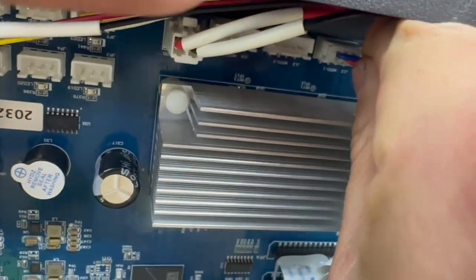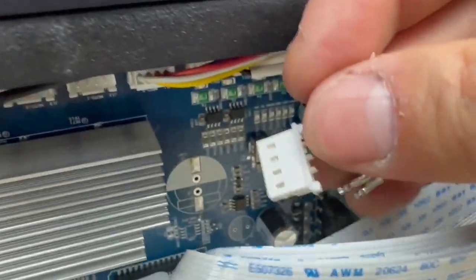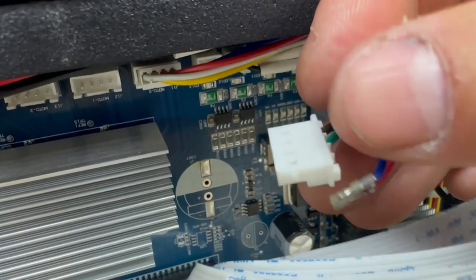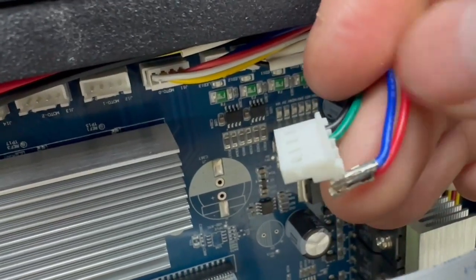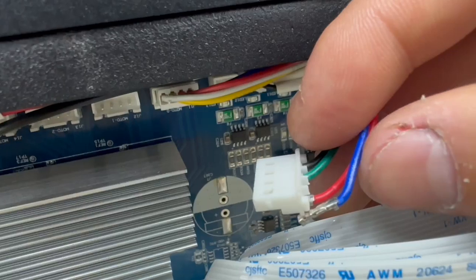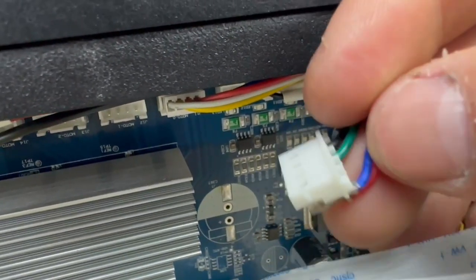If you plug it out, if you take it out, okay, I take it out more. But you will see it's 4 pin. And if it's an AABB stepper motor driver, that's why I changed the 2 wire. And that's why they're very easy to pull out now. But that's the only way you can change the feeding direction. Okay, you have to change the wire. Basically push, and they come out. Yeah, those kinds of pins.